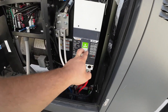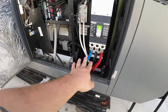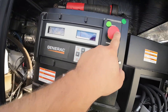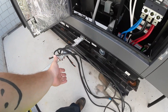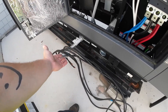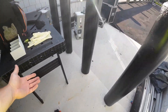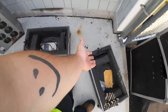All right, so 400 amp breaker, 3 pole — they already have 2 feeders in each lug, so that should be fine. I want to make sure that that's an e-stop first. But someone messed up because I only have 6 feeder cables here. I don't have any wires for the ground. There's literally 6 of them here, and then I got my power cord — but that's it.